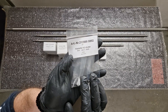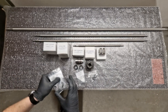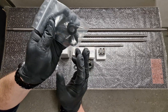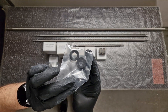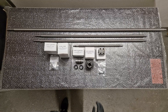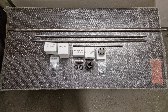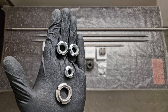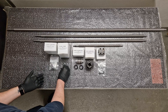Here we have some more dirt scrapers for the 20mm and 16mm ball screw nuts. Then last but not least, the locking nuts for the ball screw itself — they are essentially there to preload the angular contact bearings on the fixed bearing side of the ball screw.